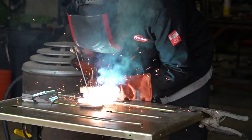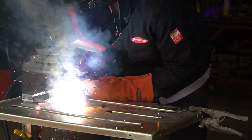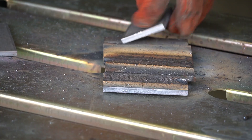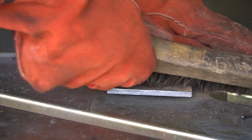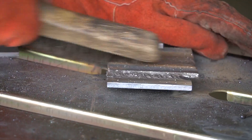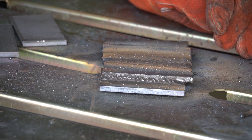I really fancy myself on 7018, which cannot be used on this machine unless we find a way to convert to DC. Either way, I got it started and fired up, got in behind the arc — this is actually really smooth. It behaves like a six-series rod: very violent, cuts its way in, no problems. I can't lie, I was kind of taken back with a little nostalgia factor. Here's a 70-year-old machine doing it the way they used to back in the day. It's pretty cool. I'm definitely experienced on some of the older machines like the Lincoln buzz box and tombstone, and I'm surprised this one is very, very quiet. My 6011 game needs some improvement — maybe a little practice.